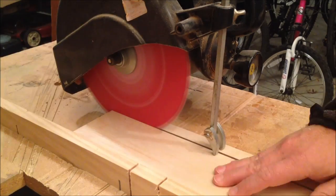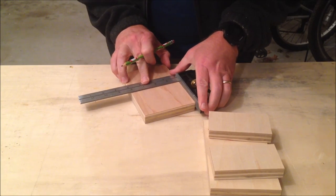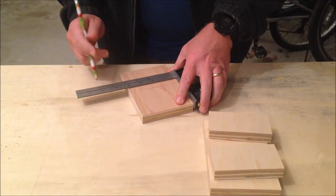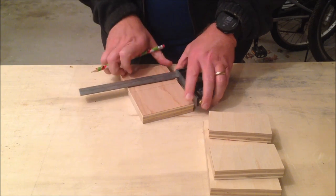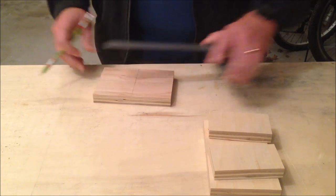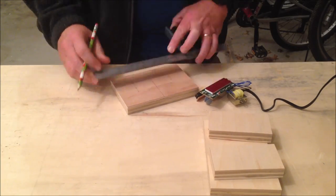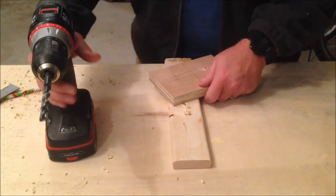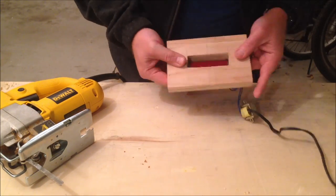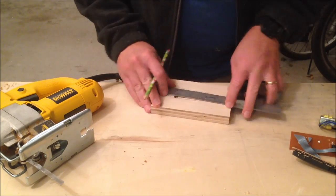Then I went to the radial arm saw and ripped all the plywood to the right size for the boxes, and then off to the miter saw to cut everything to length. On the front of the box, I marked out the center so I could use that as a reference point when I marked the opening I was going to be cutting. I measured the size of the LED screen and marked that on the wood. Now this is my first mistake — I should have measured the size of the whole board. I drilled some holes and then used the saber saw to cut the opening. The blade bent so the opening really wasn't square, and that whole board needed to fit into the plywood so the LED panel would sit flush against the front of the wood.